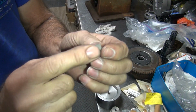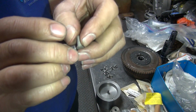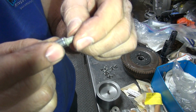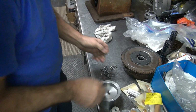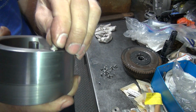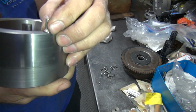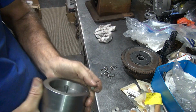This one here is a large diameter, full size. So if you flip this around backwards, this one takes up the whole head of the rivet. And when I made it, it didn't have a big chamfer like this. It's flat, but anyway, it's in there. That's this one up in here. So it covers up most of the whole head of the rivet. It'll push in there flat and stick up like it's supposed to, not just put a dimple in the center of it.